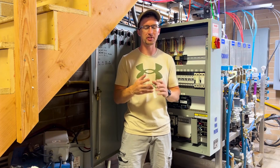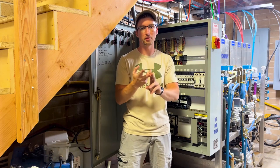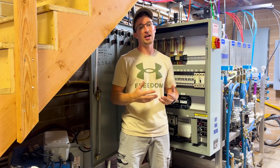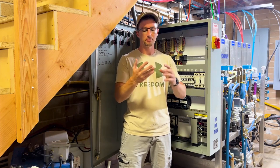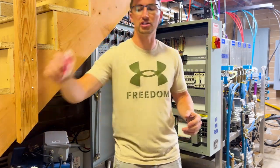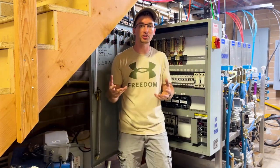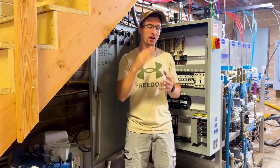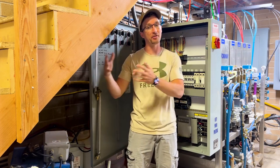You also need to decide where the booms are going to go in your bays. I'm starting to get more features inside my car wash bays and starting to run out of room — in fact this might be the last boom I put in. And then the last thing is your meter boxes. The meter boxes need to have a function that you can assign to the air chamois, so I'm basically going to eliminate a rinse function and put air chamois on that, though I have other rinse functions as well.